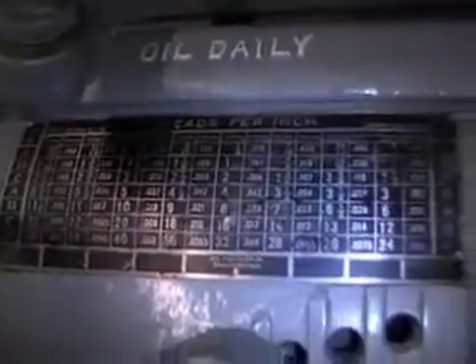It has 56 feeds. The main motor on this machine is a 20 horsepower main drive motor — it's 220 or 440 dual voltage. The machine weighs about 16,000 pounds. The taper in the tail stock is a number 6 Morse taper.